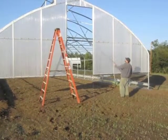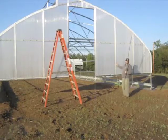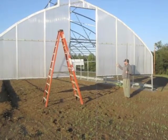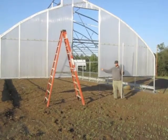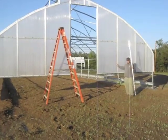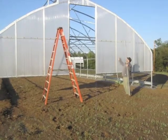After our first piece of single H was in, we then found our vertical stud, and we wanted to make sure that we lined our polycarbonate seams up with our vertical stud. We had to trim this piece slightly to get it to fit, so what we did is we put our factory edge inside of our first single H channel, and then we put our double H channel into our cut edge on the ground. So we put up the polycarbonate and the double H channel as one piece.